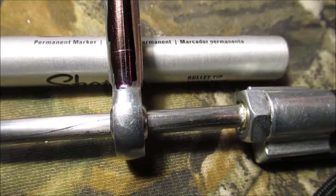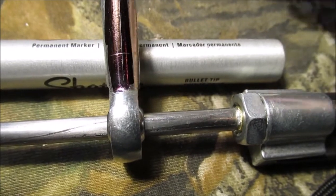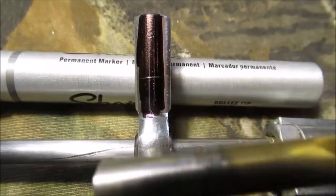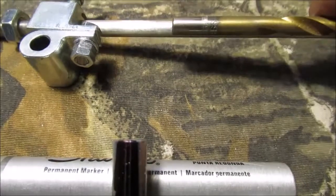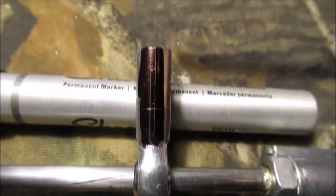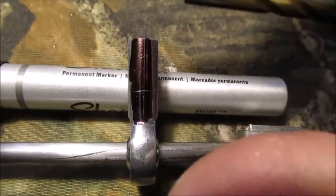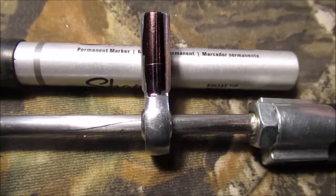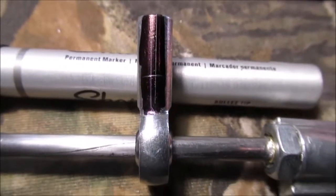The hole we're gonna drill is with a 9/32" drill bit — I'll put that in the description so you can reference it. That's what we determined is close for this rod, because this is like a seven millimeter oddball rod. The object is to drill down here so this piece will slide down the rod. We have a set screw Allen screw that goes in this end, it locks in, and we want to slide this piece up and down.